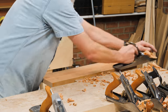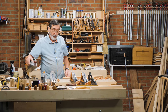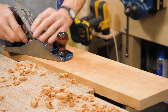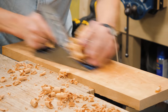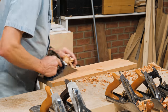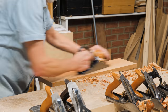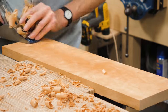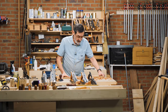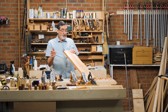When I reach a certain point and I've got continuous shavings, I might go for another wide plane — this is a number four and a half, the same length as a number four. This one is great because it will follow a hollow a little bit, but not too much. I keep going until I get a more continuous shaving, and that, as far as I'm concerned, is the best strategy for planing wood true and flat. Using that system of planes works really well.